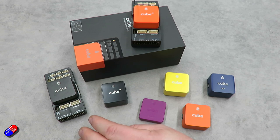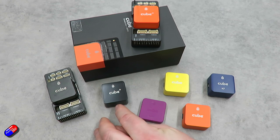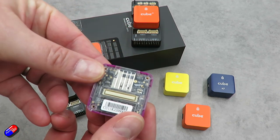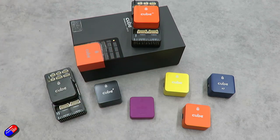There was a slight product change due to discontinued IMUs in the Cube Black, so a temporary release called the Cube Black Plus was made. Alongside the Cube Black, there was also the Cube Mini or Cube Purple. The Purple doesn't have all the features of the standard cube — it lacks dampened or heated IMUs — and is intended for ground vehicles like rovers or boats rather than aircraft.